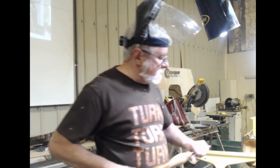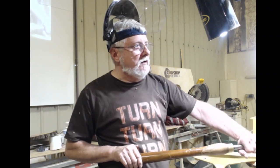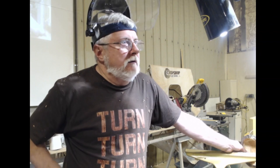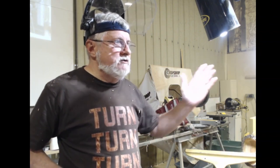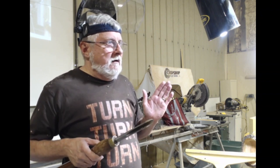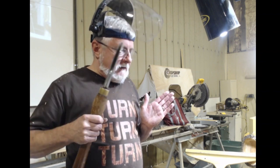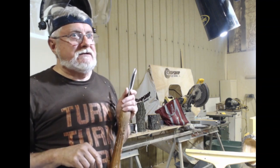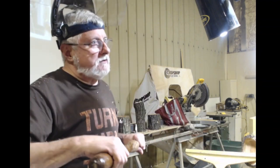Of other little things. Notice whenever I'm taking the tool in, it's all one smooth motion and it goes all the way around. The hardest part in turning any bowl is kind of where the side and the bottom start joining. It's very easy to be a little too aggressive with your cut, and then you have a smooth outside and the inside is sort of shaped like this. So just doing a smooth motion kind of helps with that.